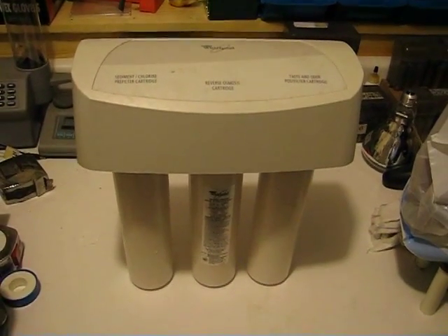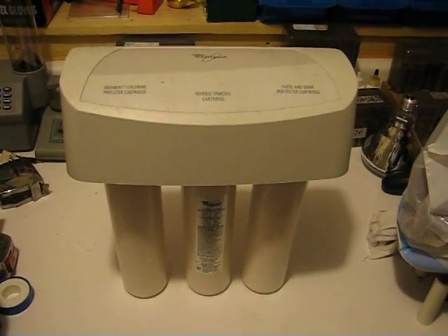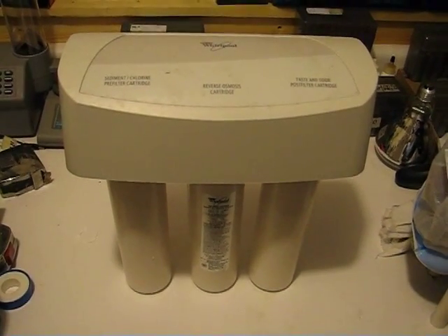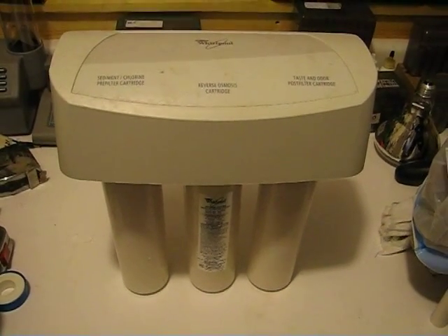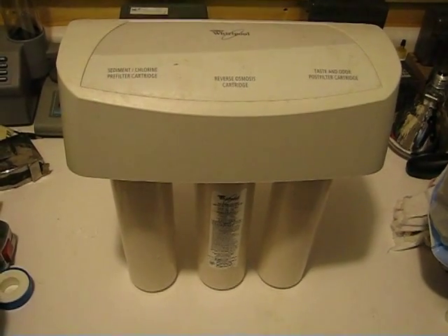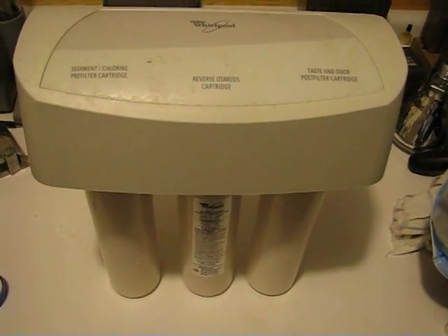This unit did a pretty good job and produced all the water the household needed for a number of years, but plastic does fatigue and get old, and when placed under pressure, dimensions can change — which caused my water damage. To extend the life of the sediment chlorine pre-filter, I added a whole house filter as a pre-stage and a second large carbon filter for additional buffering. When I repaired the unit, rather than installing another three-stage unit, I simply replaced it with an RO membrane, which is what we'll see in a moment.